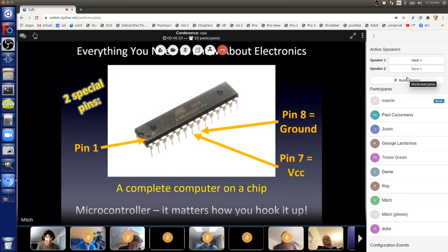And the data sheet shows you a picture, and this picture I have on my screen right now is from the data sheet. There's two things that mark a chip, and not all chips have both, but all chips have an indented black dot in one corner, and that's right next to pin one. Many chips, including this one, also have an indented half circle at the top of the chip. In the picture, it's shown at the bottom, but that's called the top. And to the left of that indented half circle is pin one.